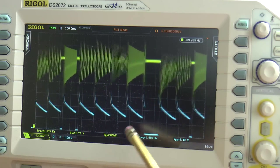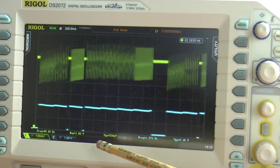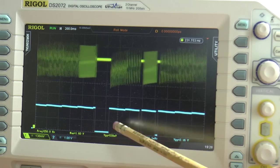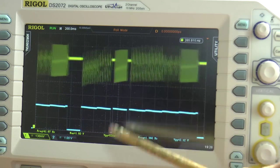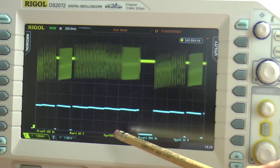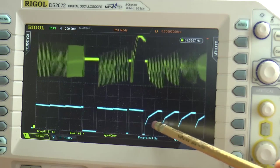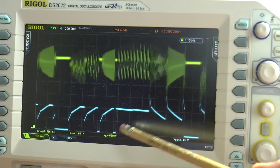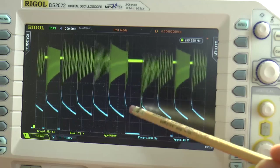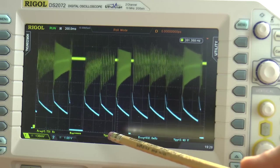That's this one. Now, all of the clicking and popping happens only when the envelope generator changes voltage dramatically and quickly. So in the case of the square wave waveform, it's only at those moments it's dropping down or going up from zero, these obvious spots. But on the slowly attacking waveform, this one, and also the sharply attacking waveform, this one, you notice there's other moments where it's not going down or up from zero, but it's just rising up from a decay. And those are also sharp moments.